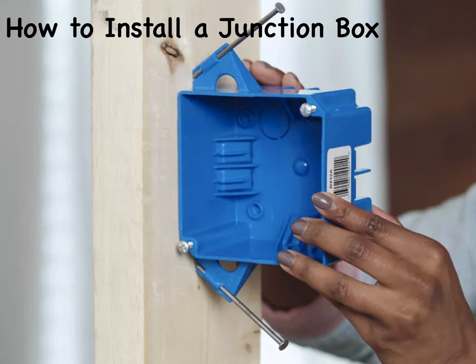The National Electrical Code, NEC, dictates that no wiring splices are allowed outside of an approved enclosure. Any standard outlet, switch box, or light fixture box can serve as an approved enclosure, but where a wiring splice needs to occur in other locations along the circuit, the approved enclosure is usually a junction box. A junction box is simply a standard electrical box that is mounted securely to house framing or another structure, containing the connection, or splice, of two or more circuit cables.